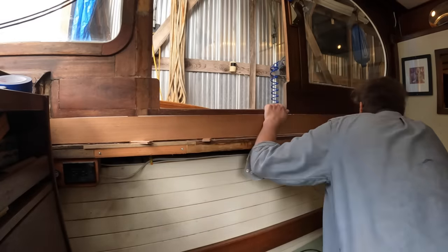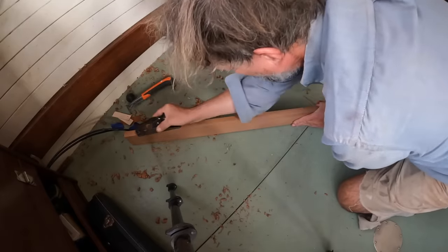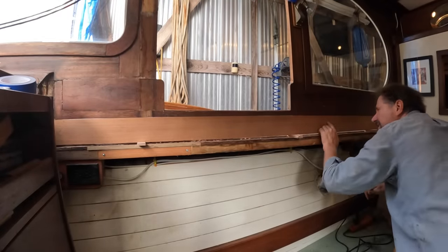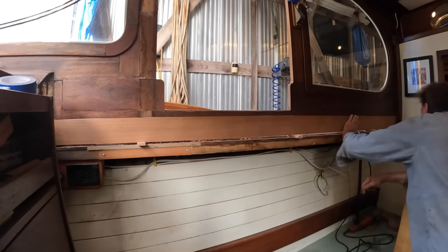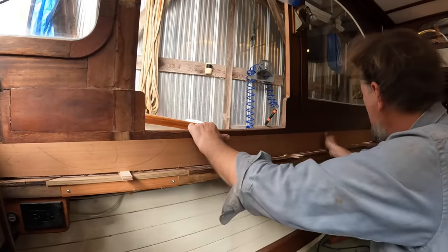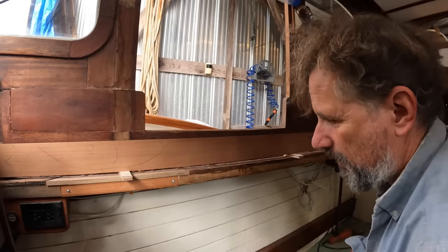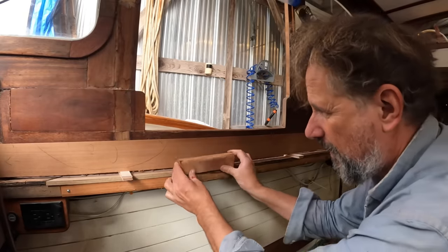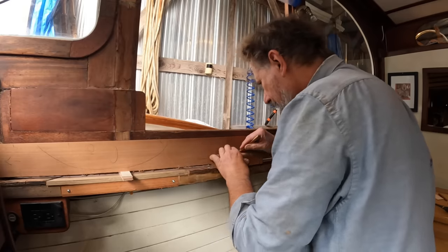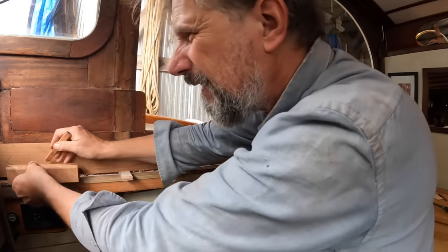I've done a little sanding, a little planing and it's getting close — maybe just a little bit of a gap here, and I think I've got to take that up way back here. After a few iterations of fiddling, I'm quite pleased and it's ready to be attached, with the exception that the bottom now needs to be trimmed to fit into the rabbet on the sill. Here is my sample cross section of the sill — I'm just going to use that to scribe all the way along where the bottom of the cabin side needs to be cut. Easy peasy.